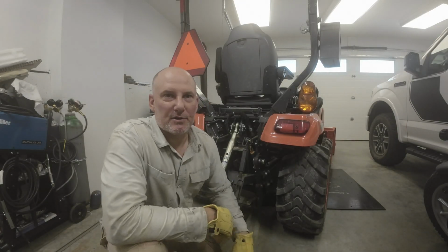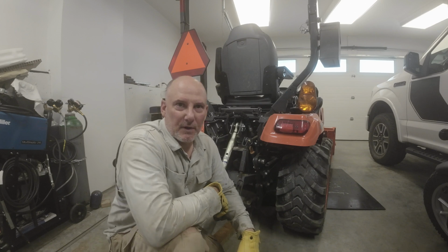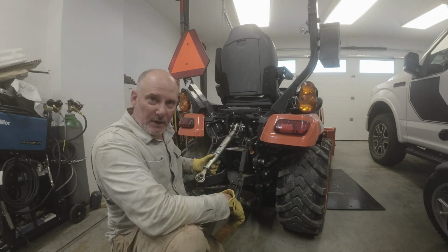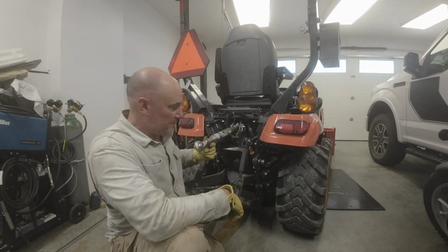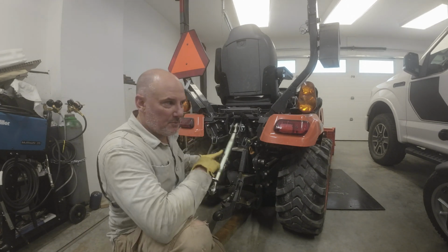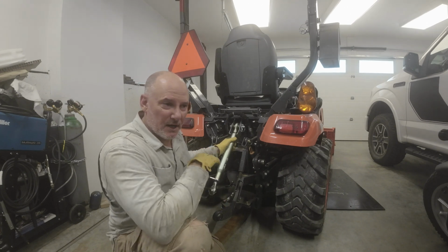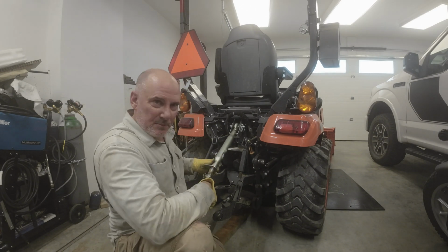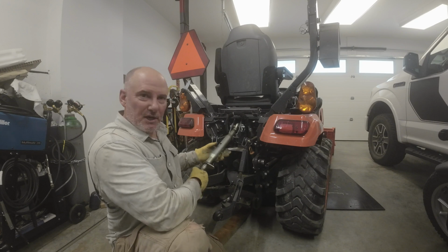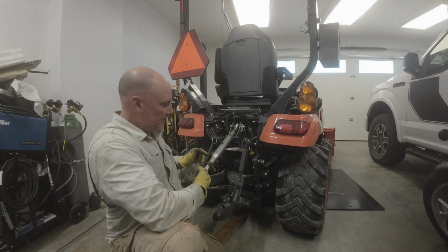Hey, thanks for watching another episode of Maintenance with Mike. So that is fixing the top link on a 3-point hitch for a Kubota BX23S. As I said in the beginning of the video, I've already wrecked the original one that came with it. This was my second replacement, and I bent this up pretty good on the top piece, the top link attachment on the box blade. I lifted the box blade too high, bent this little tab back, so we zip cut it off, welded her up. Now we've got adjustment again, and we can turn this forward and back to lock it on the barrel.